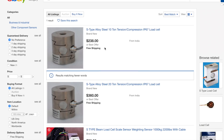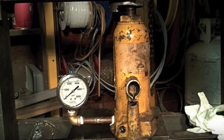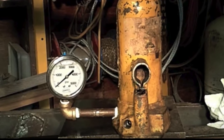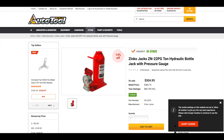First, I thought about using a load cell in combination with my press. A load cell is a device that'll measure compression and tension forces, but for one that's 20 ton the same size as my press was pretty expensive. Then I looked into adding a pressure gauge to my bottle jack — you can use the PSI it's exerting to calculate force — but that has the potential of ruining your bottle jack outright if you do it wrong, and also compromising its structural integrity because you're drilling into the casting. Then I looked for a bottle jack that already had a gauge on it: one for $384, another for $505, and one for around $150. But that still seems silly — I already have a bottle jack, I just need a gauge.